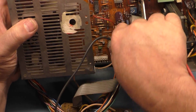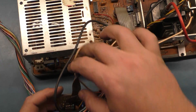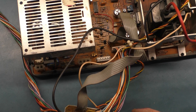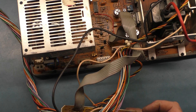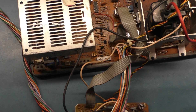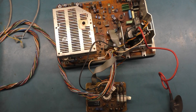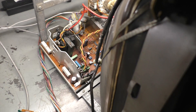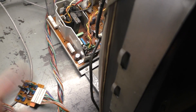Okay, anything else break from moving around? No — ribbon cable's good, ribbon cable's good. All right, let's hook it back up to the tube and see if that fixed our issue. So here we go, all hooked back up. R40 has been changed out — as we saw, it was bad, new one's good. Let's see if that fixes our all-white screen.